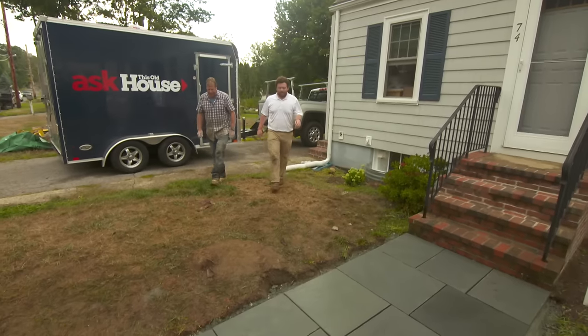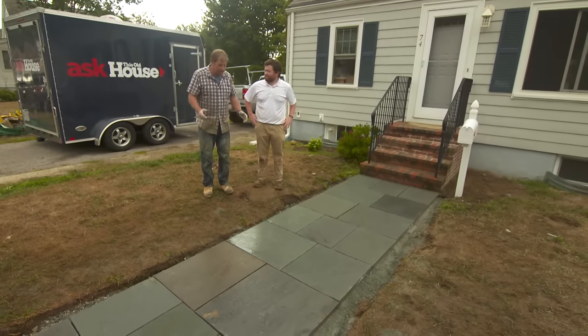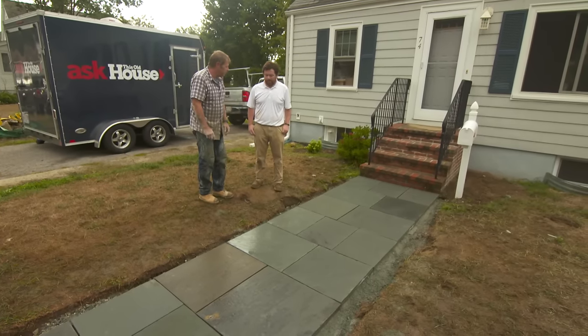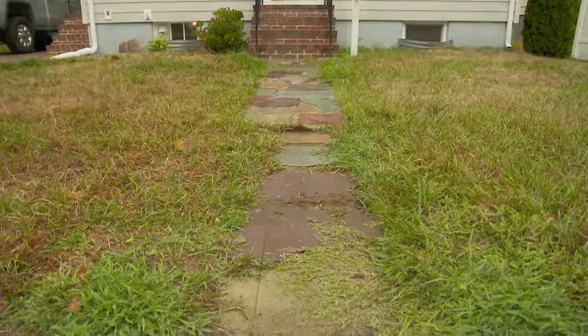What do you think, Dave? Looks perfect. We had a little obstacle — a lot of rain during the day slowed us down a little bit, but it came out great. Now the sun's coming out. The next step would be spreading polymeric sand in all the joints and then wetting it down — it gets hard and stops insects and weeds from growing in the joints. But it's moisture activated, so if we spread it now it'd stick to everything. I'm going to leave you a bag — read the directions, put it in the joints, blow it off, but make sure the walk is dry, a good two or three, four days without any rain. Looks beautiful — quite the transformation.